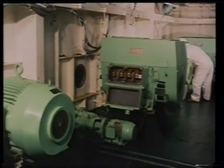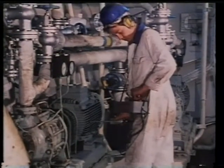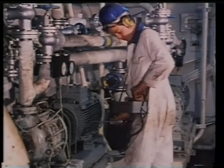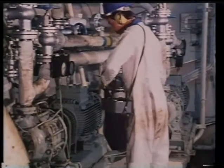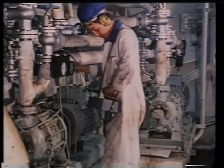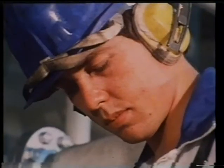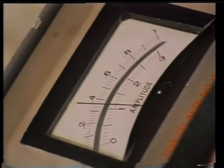How much maintenance and repair of motors is carried out on board ship depends on company policy. The most modern approach to maintenance relies increasingly on vibration monitoring and insulation resistance trends to determine maintenance schedules. Developing troubles are detected and remedied in time, without a motor having to be withdrawn regularly from service, as in the case of planned maintenance schedules.